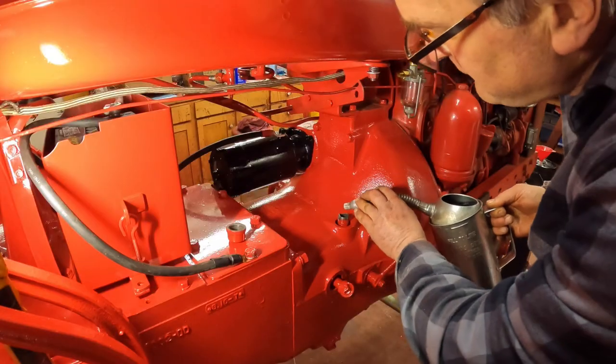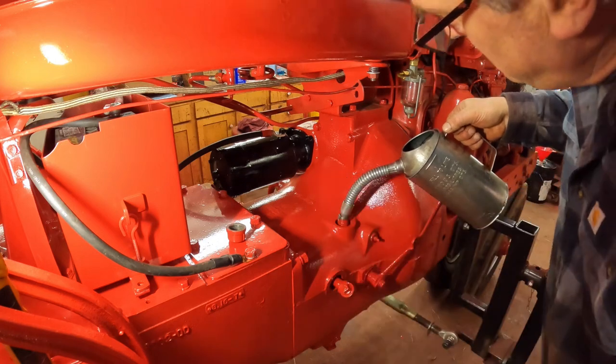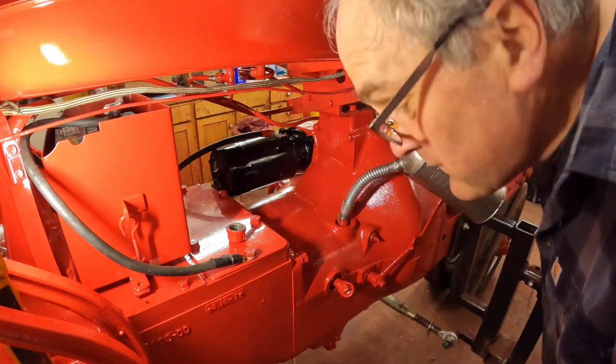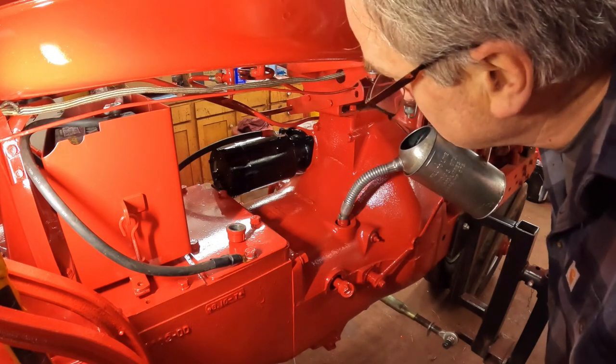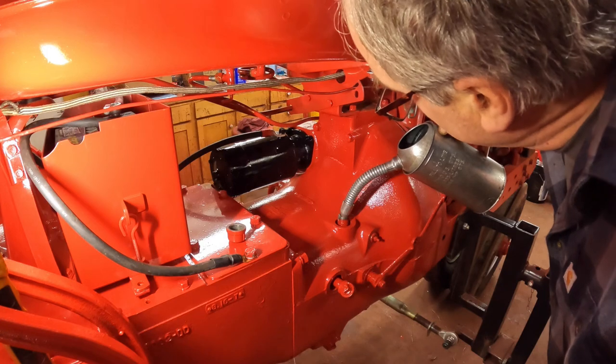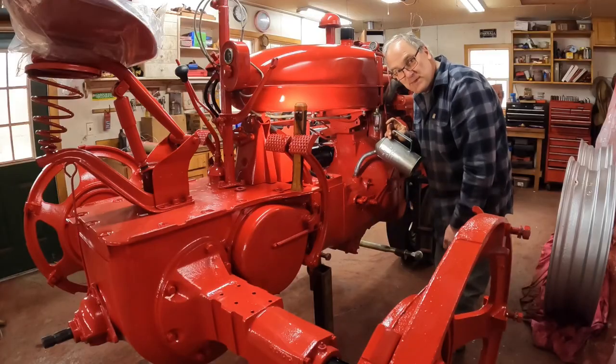And of course we have to fill up the lift pump, the hydraulic pump. And I use the good Accela Hytran for this because that's what I run in all my other tractors, and this will be interchanging hydraulic cylinders with the other tractors. So about 6 quarts of Accela Hytran. By the way, this whole part is not complete yet.